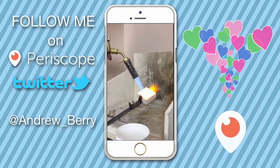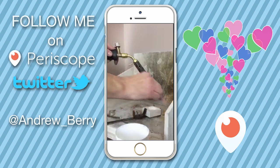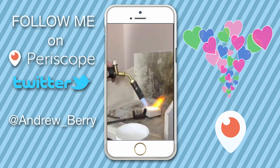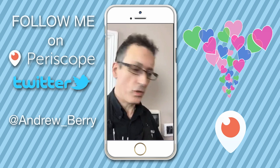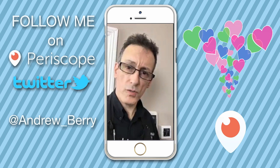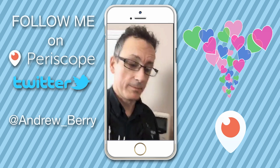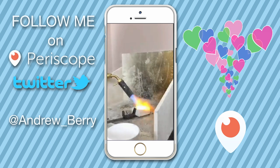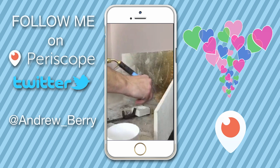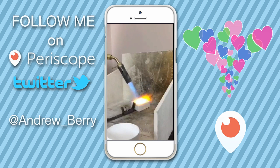You can't really see it on camera, but it's heating up quite nicely. By coating the surface, it's going to stop the silver or the gold sticking to the crucible — which is what so often happens, and people just don't tell you about these sorts of things. So if you carry on heating, that'll stay there.